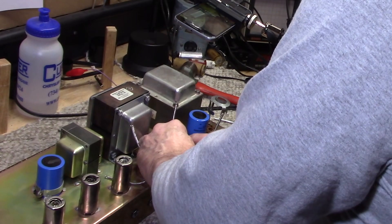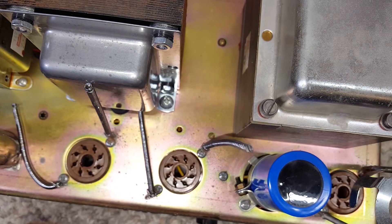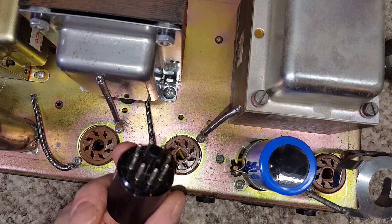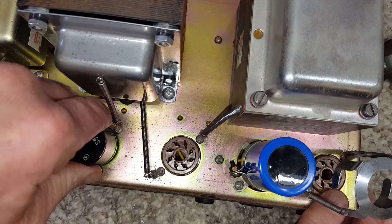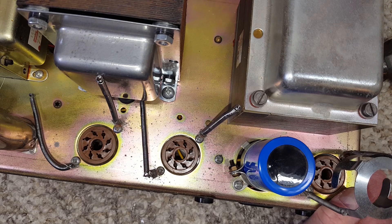For this I'm going to use a little piece of wood on top. I do not want to use one of those KT-66s to check it out. This is a rectifier replacer and it has all eight pins, so it's really good for putting pressure on sockets. We did it — that's beautiful, it's nice and tight again. This one feels like it's still in pretty good shape. So we did it without having to solder or any unnecessary expense for the customer. I'm going to put this thing back together again. It was missing its tube retainers.